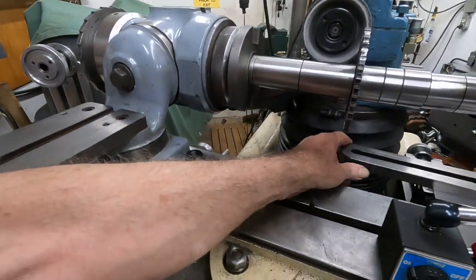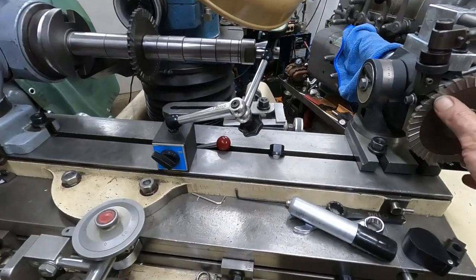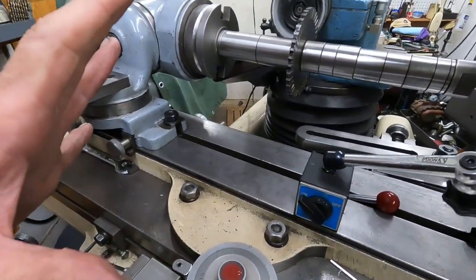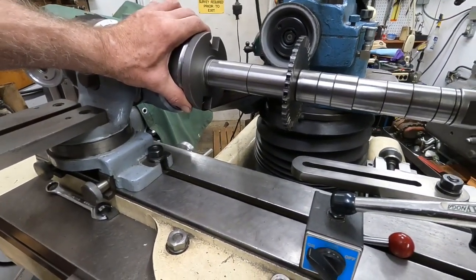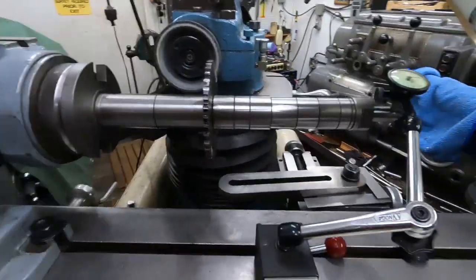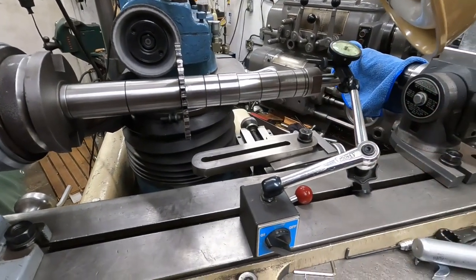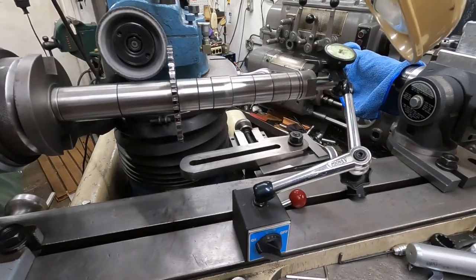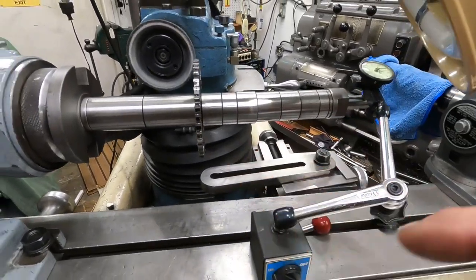So the next thing I got to do is adapt a finger, one of these ratchet fingers. I used a solid finger before, and it's really quite cumbersome. So I'm going to take advantage of having these ratcheting fingers, and I have to modify the holder here. Now, this is an adjustable finger rest, but you use this one for spirals because, see, it stays with the machine. So I'll just take this loose, hook it to the table for this cutter here.